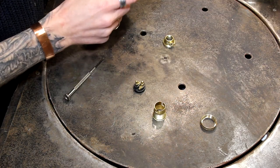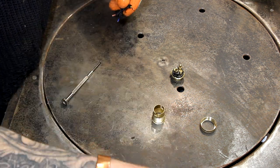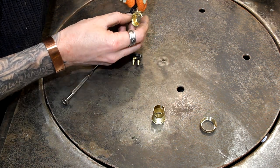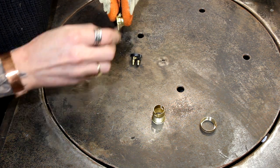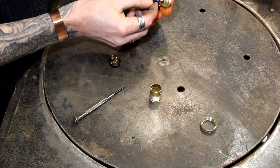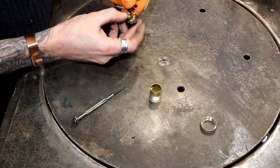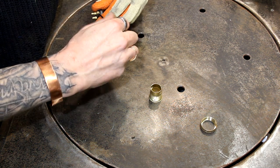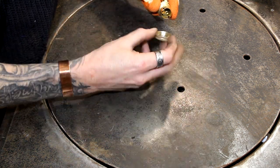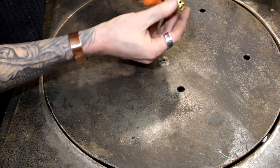By European standards, yellow and green is earth — so that's the earth going into that terminal. These two go through here; it doesn't matter which of these two they go into. That goes on there, and then the retaining ring over the top. That is wired up and ready to go in.